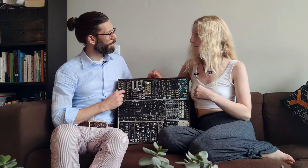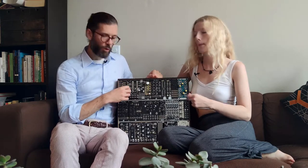The first one we built was probably the more complex one. Yeah, for sure. Was this GetGud. Yeah, that one is a little bit hard to build. I would say they're still quite noob friendly. Yeah. But you have to solder precisely when you're working around really small SMD parts. And also, for example, it's good to know that these parts need a little bit of extra solder, because it fulfills a structural role to keep them in place when you plug different jacks in. Exactly. But as long as you keep that in mind, super easy to get started with these.